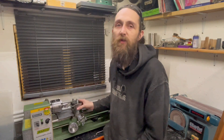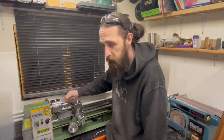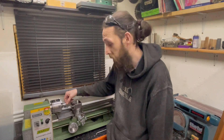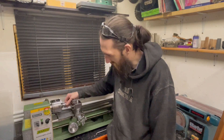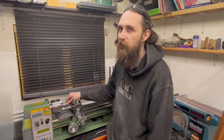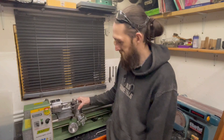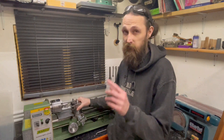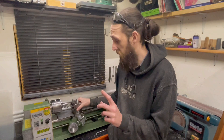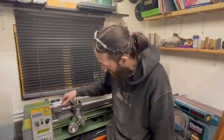Okay guys, thanks for watching. To be honest, it seems like it leaves a better surface finish, but it's most certainly not wanting to take any deeper cuts. There does seem to be a bit of vibration when I try to take a deeper cut, which I've never had with the carriage before. It's fairly solid — there is no movement in it at all. There was slight play when I had the carriage on it, so it's definitely eliminated that, hence why we're getting a cleaner surface finish.